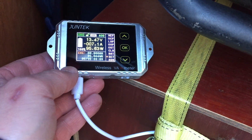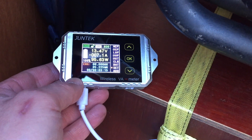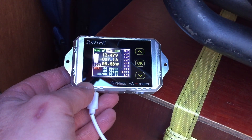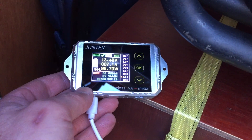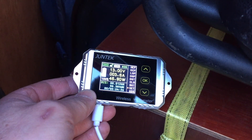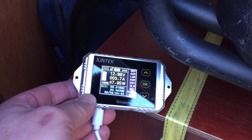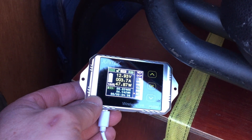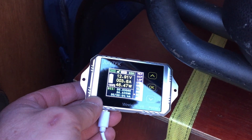That wasn't bad for a cold start — it's not been started for a week. With a bit of fiddling around, managed to get this to show that it is actually charging: it's charging 7 amps from the mains hookup, which is a 10 amp battery charger. It's been on about two or three hours. So now I've turned off the mains hookup and just turned on the fridge — the fridge is drawing 3.7 amps, which is great. It's actually telling me what's going on. Obviously it can't measure discharge and charge simultaneously, but perhaps that's not important.